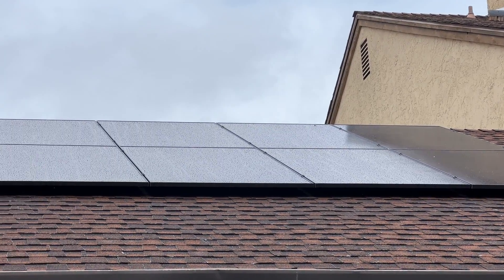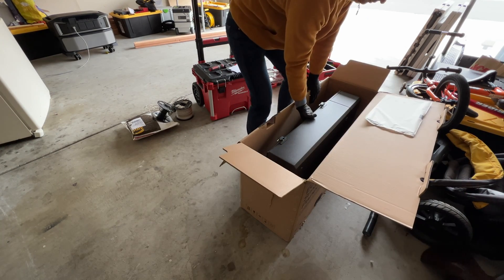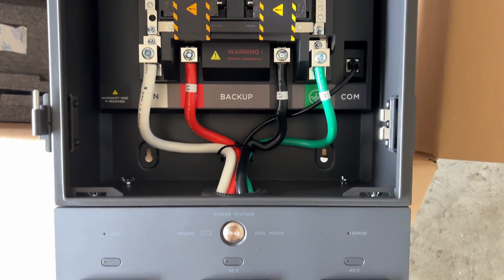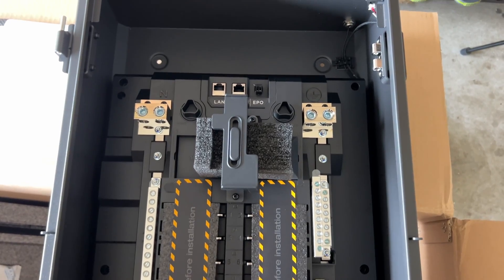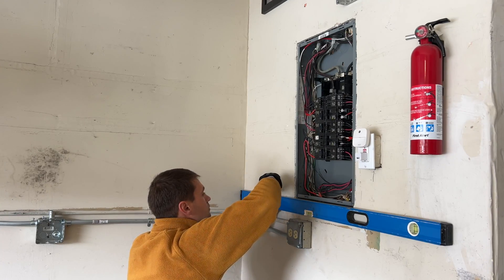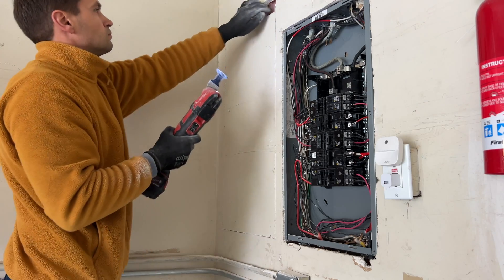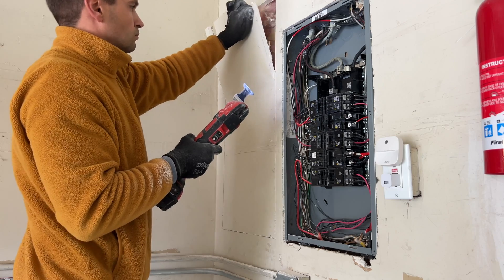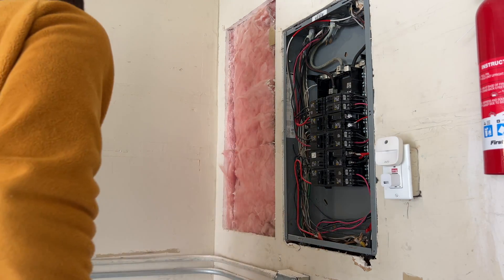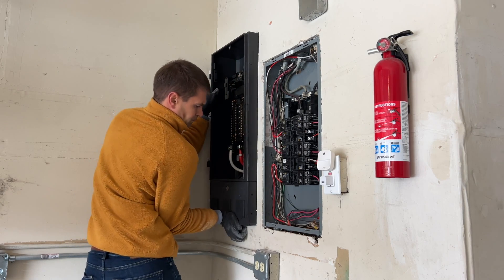If you're interested, let's jump into the video. This is my first installation of Smart Panel and what is interesting here, with EcoFlow we have a built-in interlock so we can easily connect a generator if needed. With the EcoFlow Panel we have two options to install: surface mount or recessed installation. On the left side I have space for recessed installation and it's going to be easier to run wires between the subpanel and EcoFlow Panel, so I'm just going to cut drywall and install the panel there.